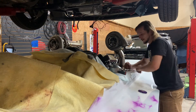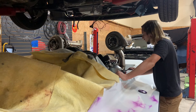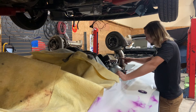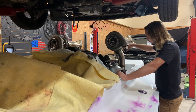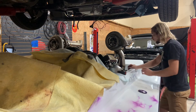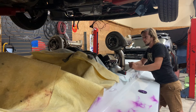I'm real happy with this header. That's all I'm going to do in this video because I really wanted to do a full video of building this side. I'll have to duplicate that side - I might not do a full in-depth how-to build a header for that side. I'm going to weld these two joints out and most likely I'm going to have the wastegate about right here - we're going to 45 out of this, have the wastegate about right here, and let the dump come and be next to it so the wastegate can catch some of the exhaust flow. We'll do that in another video.